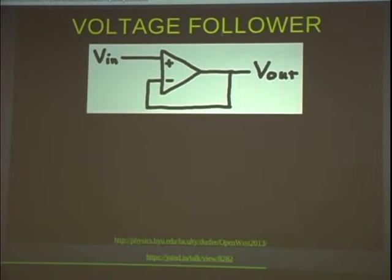Here's a cool thing you can do with an op amp — the voltage follower. Imagine you have a voltage divider feeding a circuit that sucks current: you put an op amp in between them. Your voltage from the voltage divider goes into the non-inverting input — essentially no current flows into the op amp. You connect the output back to the inverting input, so op amp man adjusts the output until the two inputs are equal, meaning the output voltage is the same as the input voltage. If the next circuit wants current, that comes from the op amp's power supply, not your voltage divider. This lets you compartmentalize circuit stages so you can understand what each one does independently.